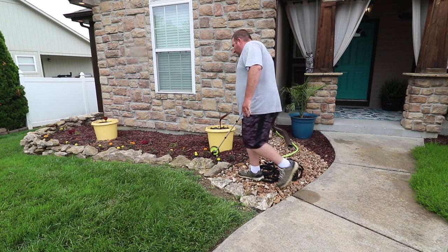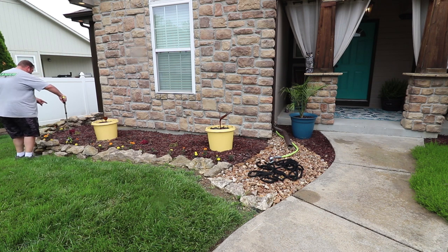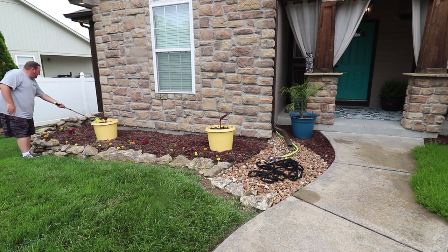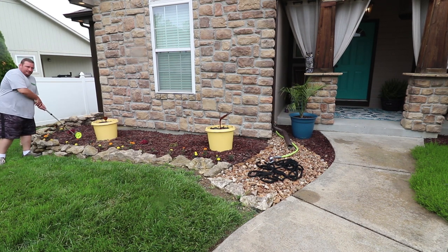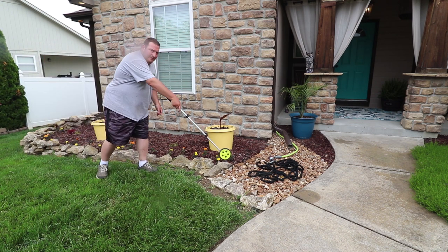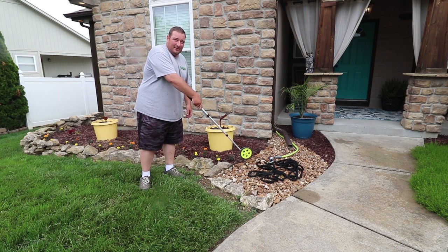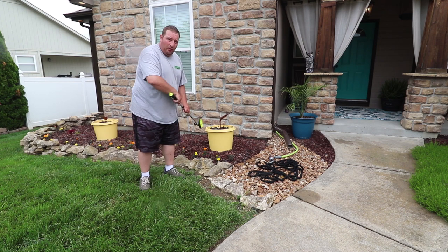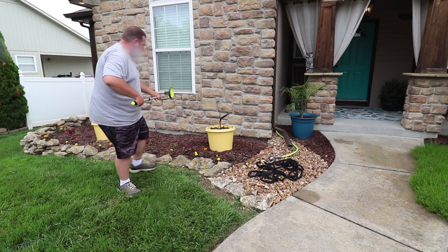4. I'm going to run straight down. And I'm going to stop it right here at the edge of this house. This is 12 foot exactly. It kind of worked out. I'm going to stop it right here at the edge of this house because this is my rectangle. Okay, 4 times 12, 48. Then you got this area, which was 3 times 9, 27. So you got the 27 plus the 48. Write these down. Write them down. Add them together as we go.